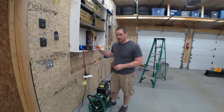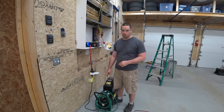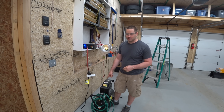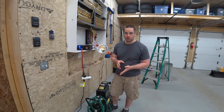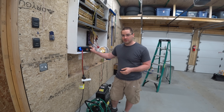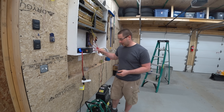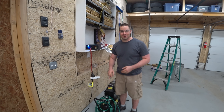So it's a 3,000 watt inverter. We're reading 14 amps, which is about 1,680 watts. But because it's a compressor, I think it can surge up to three times that, which means we would exceed the rating on the inverter. Let's see if it pops or if it can handle the surge to start a compressor.